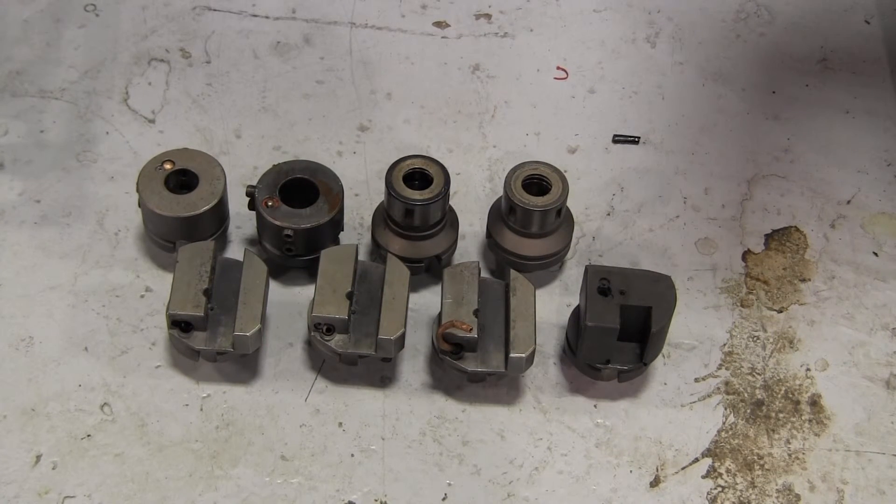One more thing for you Gary — you asked me to define the tooling that we can include, and I think this is probably a nice package for you based on our conversation. Going from top left to right: we've got a standard inch and a quarter ID boring tool; next to it an inch and a half one-piece boring tool; next to that two TG100 style collets; below that three one-inch OD turning tools; and next to that a face grooving/face turning tool — I have one of those in stock as well. If you want more ID holders I certainly have them, and if you need more OD turning tools I can check my stock or order them new.